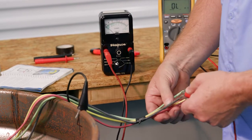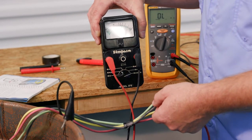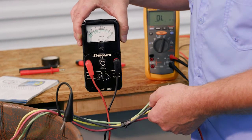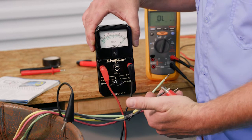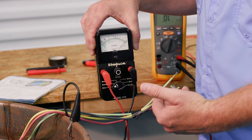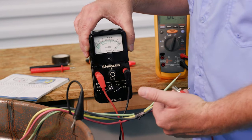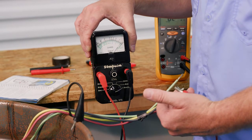Now let's check the black. We see some movement on the needle. This is measuring ohms of resistance, and it's pretty close to zero, indicating that you have no resistance between our two clips. We're clipped on the black and on the barrel. That tells us there's a cut in that black wire — because it's submersed in water, it has contact with the steel barrel. No resistance, so I've got a short — a cut in that black wire.